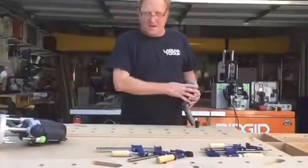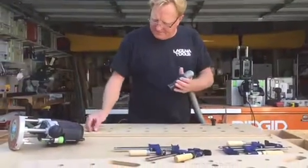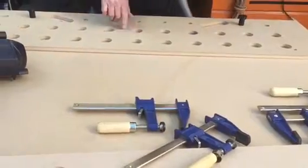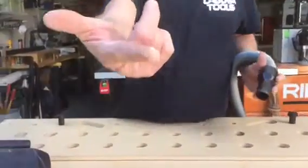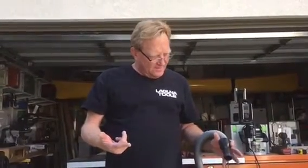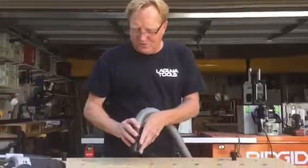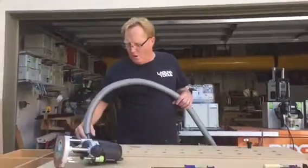Okay, so I made a first pass in the field, and you'll see that there are little bits of sawdust collected around some of the holes. Some of them you get away with clean and some not. This dust right here is the difference between a 19.98 and a 20 millimeter hole, and that is the difference between your bench dogs fitting or your Festool stuff fitting. So what I do is I vacuum out every hole.